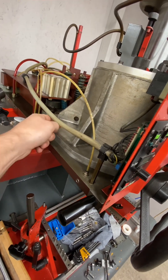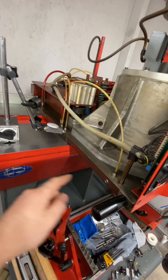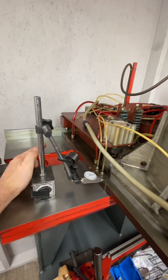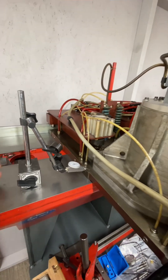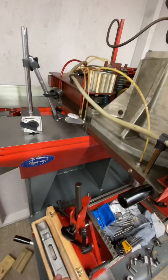One of them probably runs into here because this floats really nice, but this whole head doesn't float very well — it was lifting up. So bear with me: 0.05 of a millimeter on the back and 0.012 of a millimeter on the front — so now it's perfectly level.